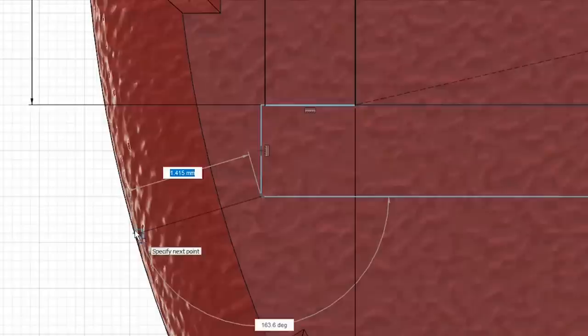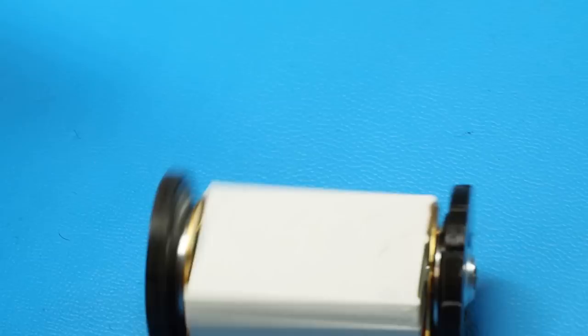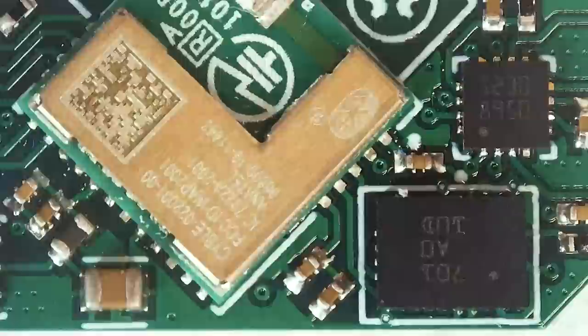Given that the battery was around two centimeters wide, it had to be placed at the center of the wheels. Ideally it would be placed underneath the axle to lower the center of gravity, but this is a tiny robot and to do that we'd have to drastically increase the size of the wheels. As you can see, the heaviest part was the orange region. Two-wheeled robots are like an inverted pendulum — the body must be balanced, otherwise it will try to spin on itself.